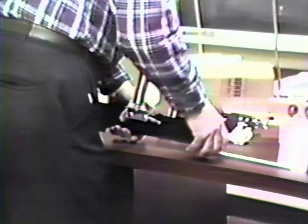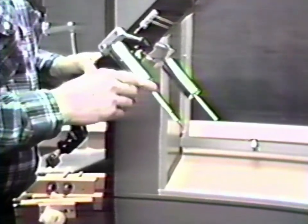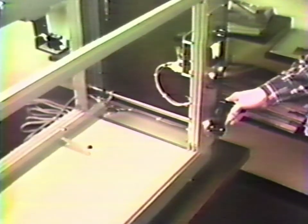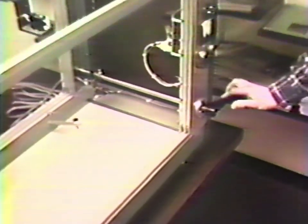Orient the beam so that the chain bearing assembly is to the right. You are now facing the front of the beam. Take note of the detector pin projecting down from the rod at the center of the beam. Open the magnets on both sides of the balance. Arrest the beam by turning the handle to the down position.